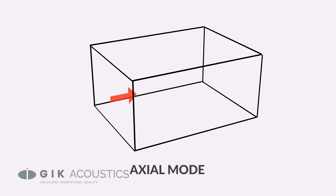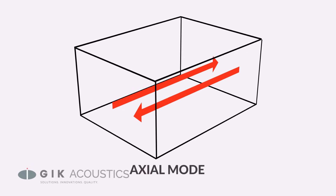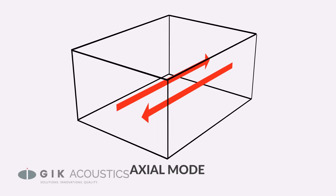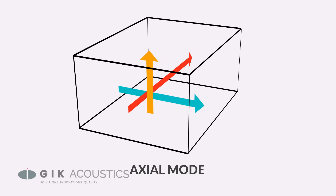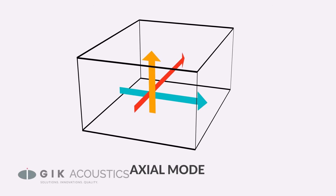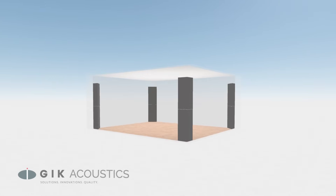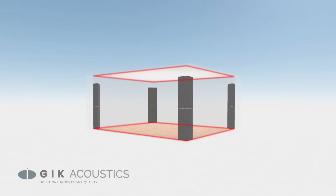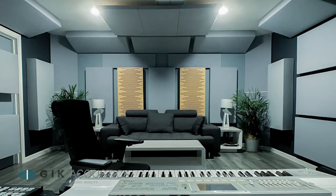The second step is to treat your corners with thick bass traps. All rooms have room modes — these are the frequencies that correspond to the dimensions of the room. The three room modes that are the strongest are going to be the wavelengths that measure the same as the height, depth, and width of the room. By treating the corners, we treat two room modes at once. This concept extends to the horizontal corners of the room that run along your room's floor and ceiling. These areas can be more difficult to treat, but they're still corners of your room and an opportunity to get a more linear and accurate low-end response from your speakers.